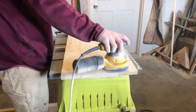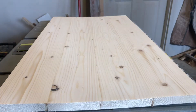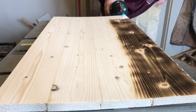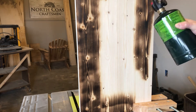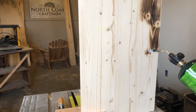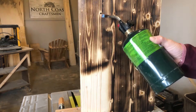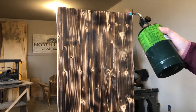Once all the glue has been sanded off, it is time to get out your torch and start the burning process. This part is fairly easy. The only thing you really have to worry about is making sure you don't hover over any one spot, because if you do, you will end up over-torching that area and it's not going to look the same as the rest of the board. Also, torches really don't like to be held sideways, so try to hold your piece vertical if possible. Try to burn both sides evenly — if you don't, you will end up with a warped panel. Trust me, I know because I did this, and I ended up having to glue and screw on a couple of brace boards to make it flat again.